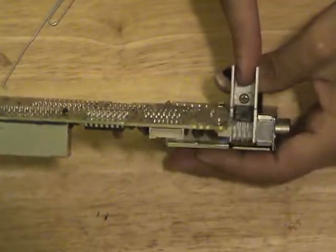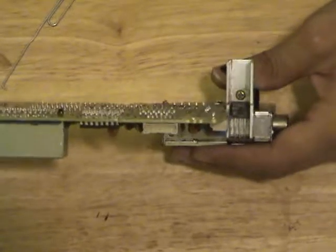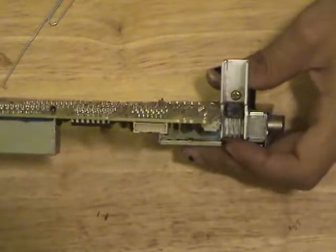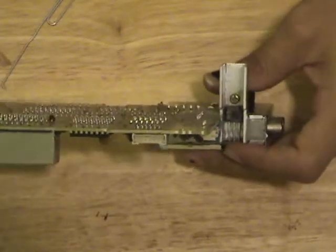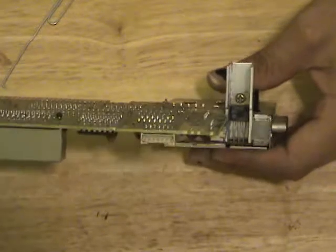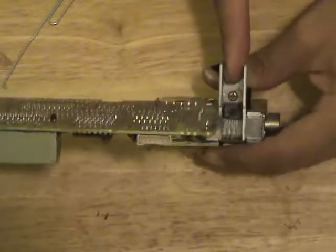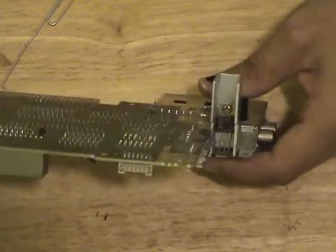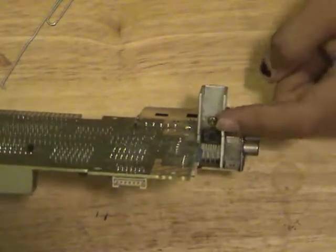You can go into a lot of common household electronics and pull out an LM7805 voltage regulator. Now, the thing about an LM7805 regulator, or all linear regulators for that matter, is they require 3 volts above their output voltage. So this is a 5-volt regulator. It needs a minimum of 8 volts to run. So typically, the NES should be run off of 9 volts. I do believe it can handle up to either 24 or 34 volts, but ideally 9 volts, or between 9 and 12, will operate the NES with this voltage regulator. Albeit, if you operate it from a higher voltage, you do put more strain on it, and it will generate more heat and it will blow out. So if your original power supply has malfunctioned and you've replaced it, this could actually be a key component of why your console doesn't turn on.